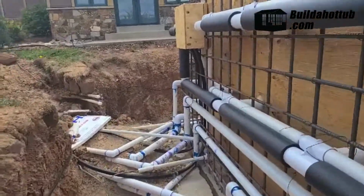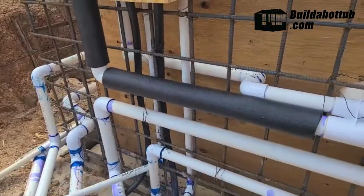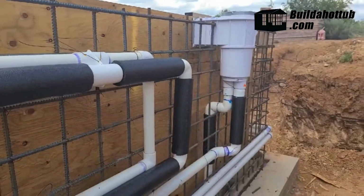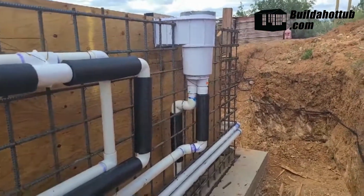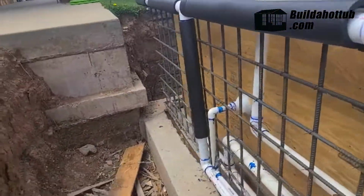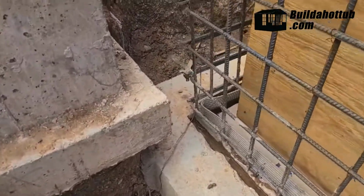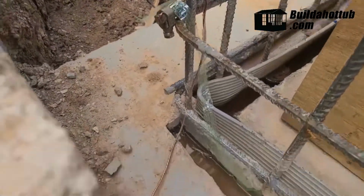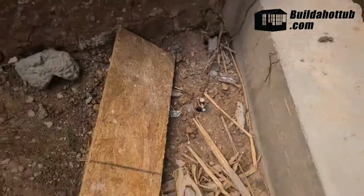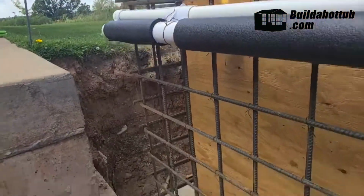There's some electricity running over here. You can see that. Wires for audio-visual system are sort of in this panel. Everything has to be circuit protected, obviously, with water. Oh, that's one other thing I can show you. They do recommend that you bond the rebar to the earth. So this is copper bonding the rebar down into this is a copper pin that goes 4 feet down in the earth for lightning purposes.